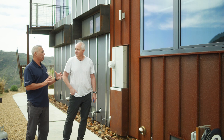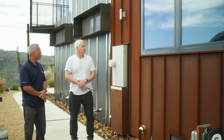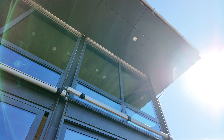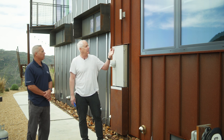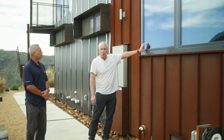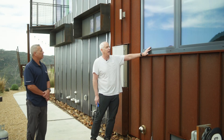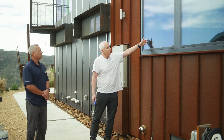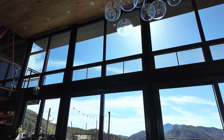No matter what you do, the windows are the weakest part of the house, and you've gone with a three-pane window. Can you talk about triple pane versus double pane? Double pane is better than single pane, triple pane is better than double. Most windows now are required to be dual pane and usually have a gas between the panes. These are European windows with quarter-inch glass in each pane. When embers are blowing and wind is at 100 miles an hour, things are flying through the air. If something breaks and shatters the outside pane — they're tempered — the window may stay intact, but it still needs to go through the second pane of glass.